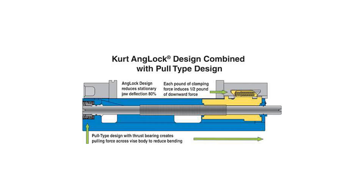Another difference is how the screw closes the movable jaw. When you rotate the screw you move that movable jaw toward the part and start clamping. Because it's a movable jaw there has to be some clearance for it to move, and as you tighten it down it's prone to jaw lift — that jaw wants to deflect or flex up instead of going straight into your part. Most CNC vises overcome this with two inclined planes acting against each other, so when you tighten the screw the top triangle pushes against the lower triangle on the movable jaw, giving you clamping force both forward and downward to minimize or eliminate jaw lift.